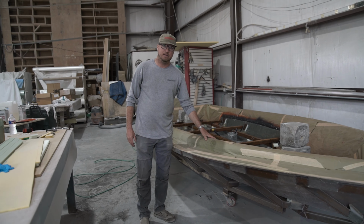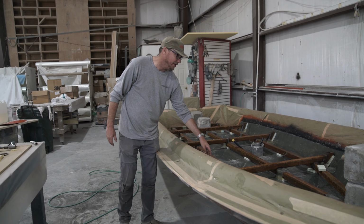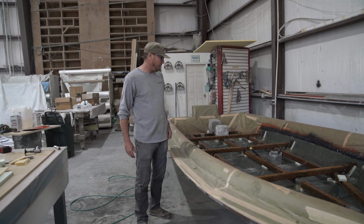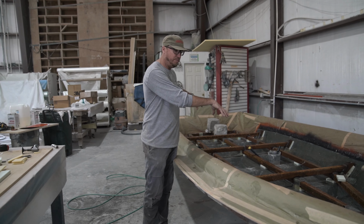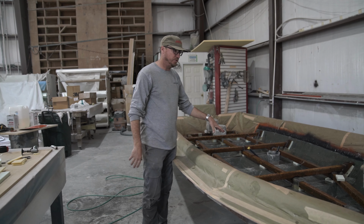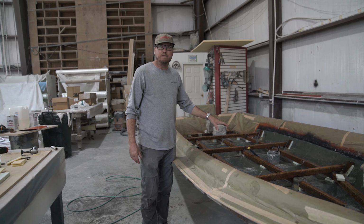And what we did after we made the part, we tooled up our stringer grid, which we're in the process of making the mold for. And this is why I look dirty and have holes in my pants. I actually welded up this frame this morning, which we just started glassing on. So tomorrow we should be able to pop this mold off the stringer grid plug. And then within a week or two, we'll lay up our first stringer grid.